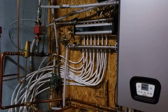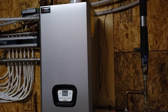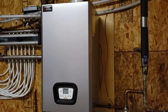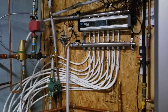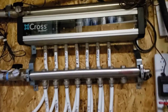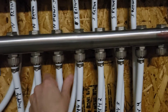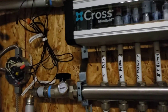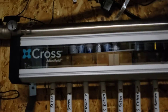What you're looking at right now is a basement laundry slash utility room. Here you have a Utica MAC 205 combi boiler, which handles heating the home as well as the hot water — the domestic — so for showers, the dishwasher, stuff like that. Over here you can see the cross manifold right there. Here are all the supplies, and then there are all the returns. You can actually pipe this either way — return here and supply on the other hub pipe — it doesn't actually matter.